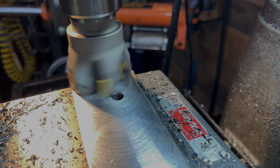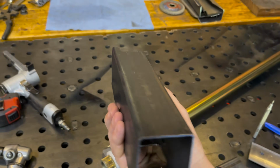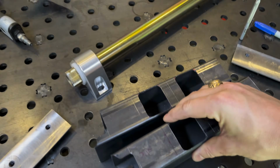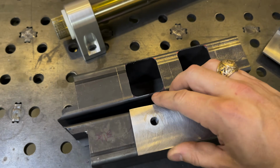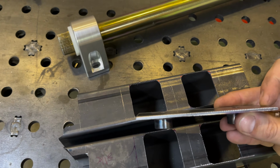This is all supposed to work together, right? You've got the anti-roll bar that's going to mount on the bottom of these frame rails, and I've got them to where they sit about like this, and there is the driver's side. You've got that one frame stub carved, but you'll notice I don't have mounting holes here. I've got these pockets that I've milled. That's where these guys come into play. They sit just like that and give me a nice, perfectly flush mounting surface, right?